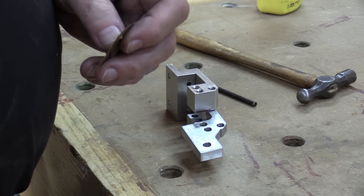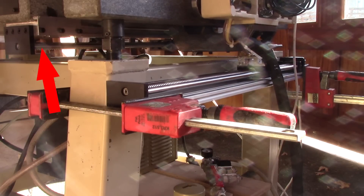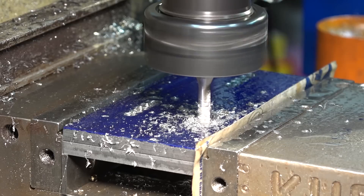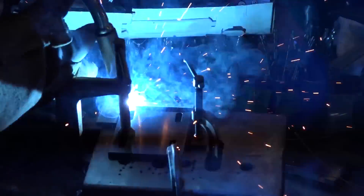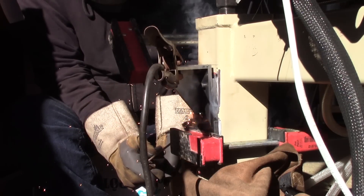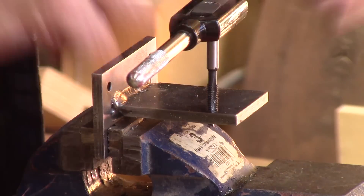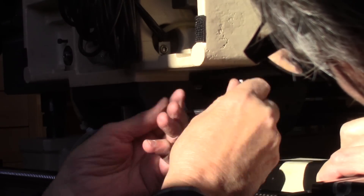When Pierre comes back with his modified bracket, we realize that the ball screw is too far away and it's binding. I use another of my ball screws and we make a test to see if moving the screw outside would make it work better. And it does. So Pierre is forced to rethink all the Y-axis. For a fourth time in five weeks, Pierre and Philippe come back to install the Y ball screw. The final touches are made, including the home for this bracket. With this last bolt, my three axes are working super fine.